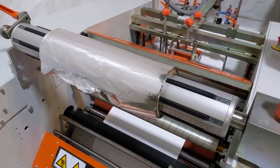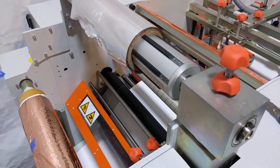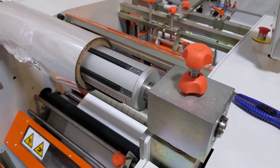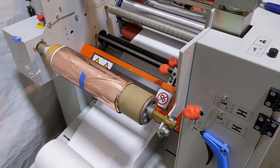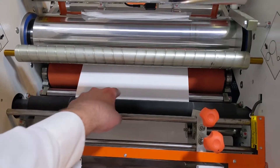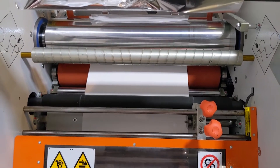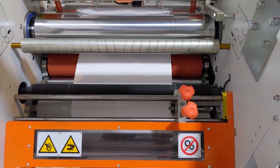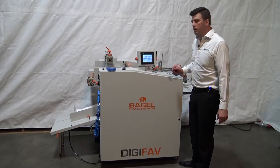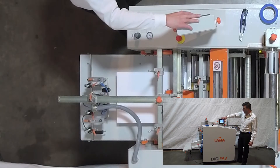This here is the tension control knob. I'm going to thread the foil through the machine, put the camera down, thread it through, and tape it onto the take-up roller. In between, there's a small plexiglass plate that I'll drop in on the decurling bar — it decurls laminations. I'll drop the plate on there, put the foil onto it, and then we'll talk about changing paper size. My paper for sleeking is a bit shorter.